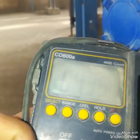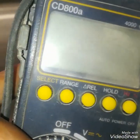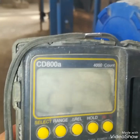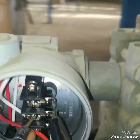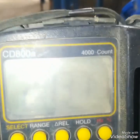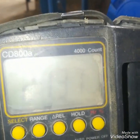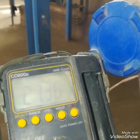As I have closed the valve and pressure supply is 0 millibar, it is showing 4.3 milliamps. When I gave maximum pressure, it showed 21 milliamps. So both the zero calibration and span calibration are out of range. I will perform zero calibration and span calibration for you.